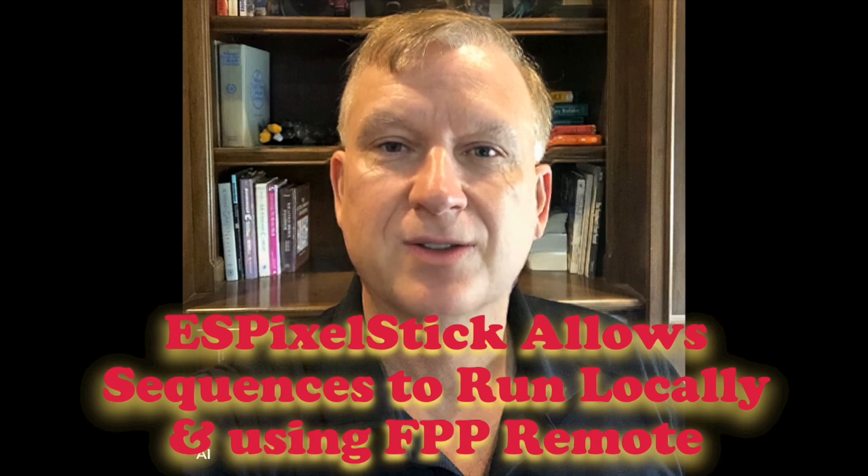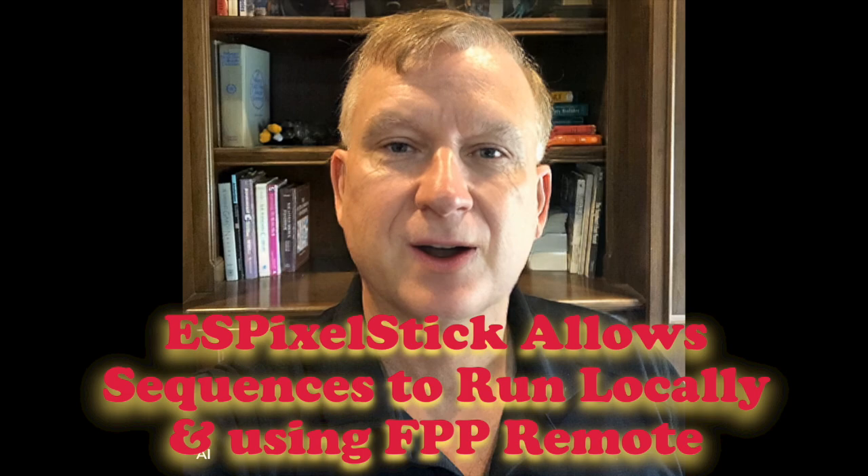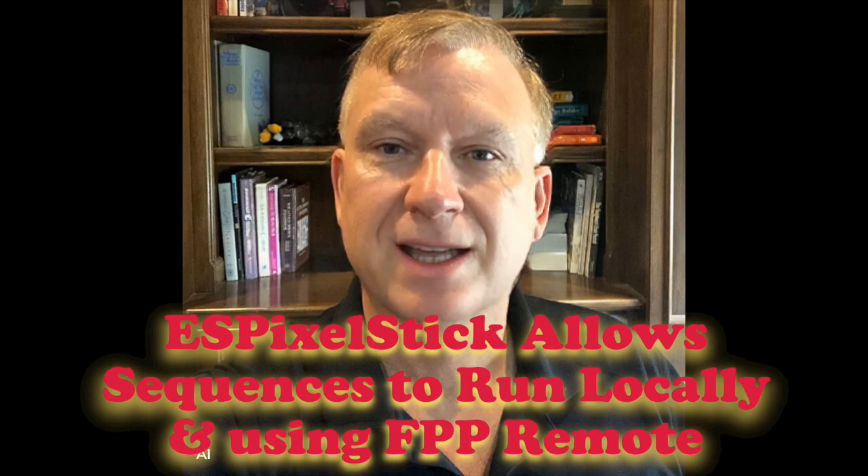I would like to be able to use the differential module and SD card simultaneously. In this video, I walked you through the wiring, setup, and configuration of the Tetra 2GO controller running ESPixelStick firmware, and how to set up and configure it in Xlights. Using Xlights to set up and configure the controller made the process very simple, easy, and mostly automated. I didn't have any issues using the Tetra 2GO controller running the ESPixelStick firmware, with the exception of having to reboot the controller after making configuration changes. Hopefully in the future, this issue will be fixed. Remember, with the ESPixelStick firmware installed, you can store Xlights sequences on the SD card and either play locally or play using FPP remote.